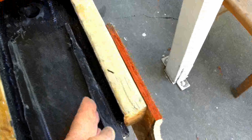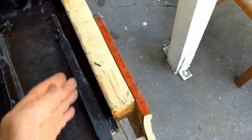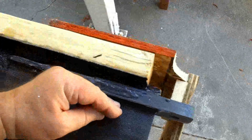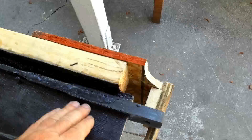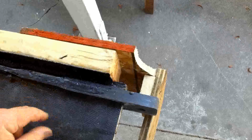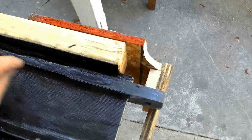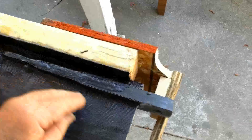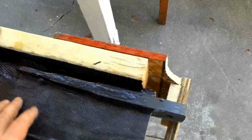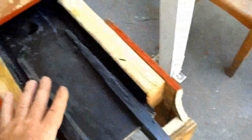It'd probably been wiser to have this straight tapered rather than step down, such that the loading would have to fail the entire bond line all at once. In other words, by making it easy to build, by having the thicker plates come along and not tapering this enough, it allowed stress concentrations that allowed a cascade failure. But that's okay, because that's not going to be used on the actual aircraft.